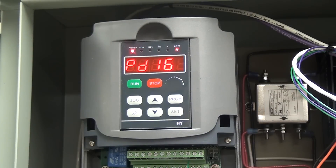And that is it. If you get all this going, you will be able to fire up LinuxCNC. You would hit F9 on your keyboard — you'd hear the relay click, meaning your VFD is now accepting commands. Then you can hit F12 to speed up your RPMs and your motor will speed up. It's a beautiful thing.